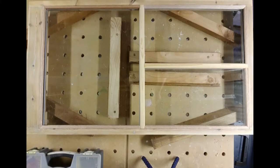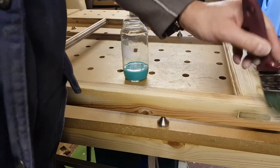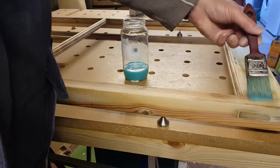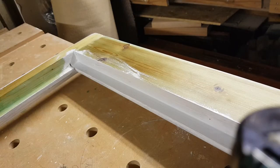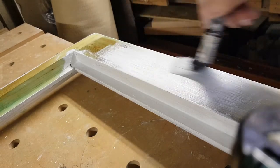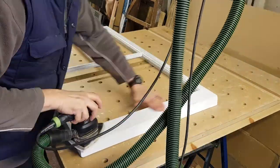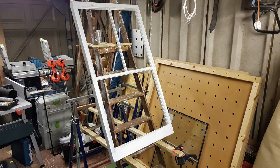Once the beading has been cut and added the whole window looks magnificent — it's a shame we have to paint them. These are some of the original frames that date back to 1929. The paint I'm using is a three-part paint: the first application is an etcher which has to be added twice with a gap of 12 hours in between. Once it's been lightly sanded down the undercoat can be added. Then the whole frame is given a very fine sanding before the final stage where we add the glass and apply the final top coat.